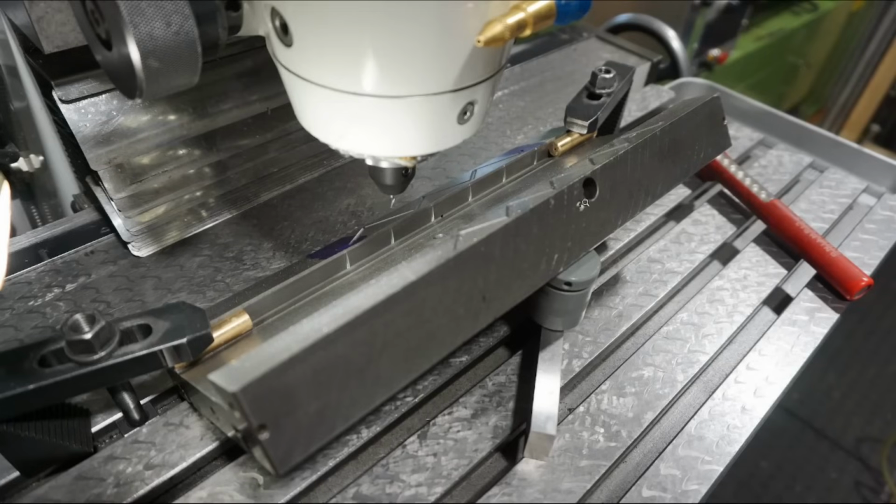I also drilled transfer holes from the outside. You see one here already plugged with an M4 set screw. The second one would be here and the transfer hole going that way. So this transfer hole connects the deep hole with this slot here. And here I'm machining those wedge-shaped pockets, also with angle offset between the sliding surface and the end mill axis, so that oil can wick into those surfaces nicely.